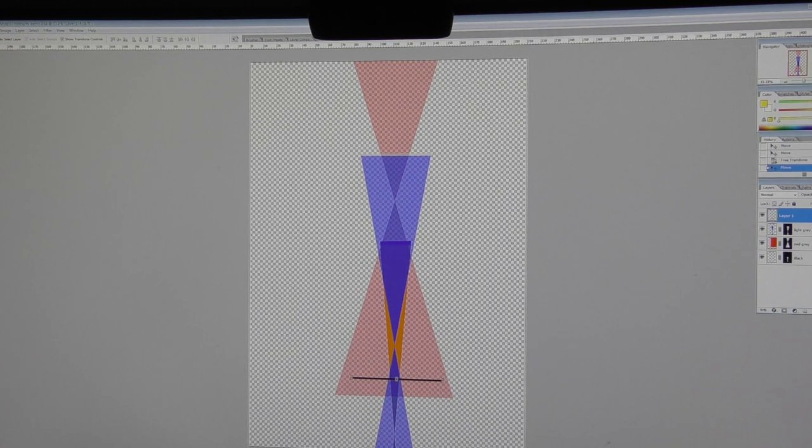So change the lens and you change this whole dynamic. Turn the lens round and it might no longer be a cutting lens as this is. It may become an engraving lens, because for an engraving lens, you do not want to cut deep. You want to just mark the surface. This is not going to mark the surface. This is going to cut into the surface deeply. So now you're looking for a completely different sort of lens to do engraving. Flip the lens over and it gets better at engraving. Not very good at cutting.